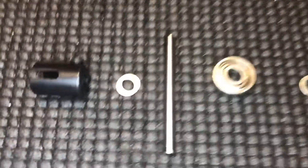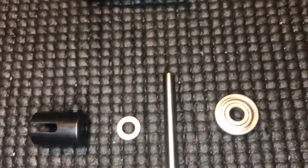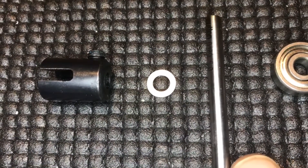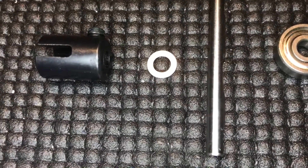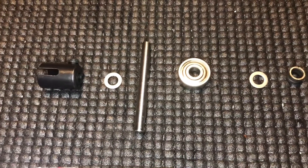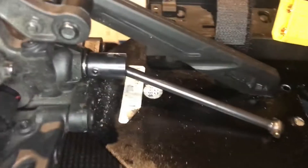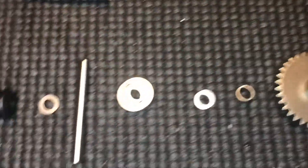I've got hold of a drill shaft — this is basically a high speed drill shaft — and what I've done is cut it down to 48 millimeters in length. That's basically the ideal length you're going to need to get the correct distance for the drive cups.